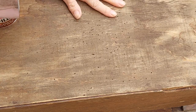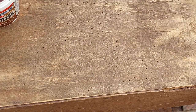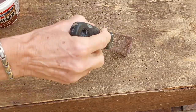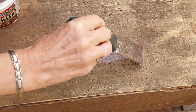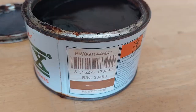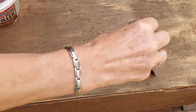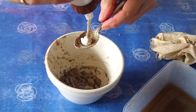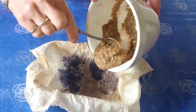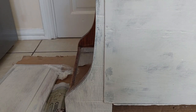Because I'm going to paint this bench, I'm going to coat the wormholes with a fine coat of filler — it just gives a better base for the paint to go into. If you weren't going to paint your piece of furniture, you could use a wax polish, which you can get in different coloured stains: light oak, dark oak, pine, and you can just work that in a few coats into the holes. I'll also leave a link below for homemade wood filler which I have used, but I'm using commercial filler on this bench because it's quicker.